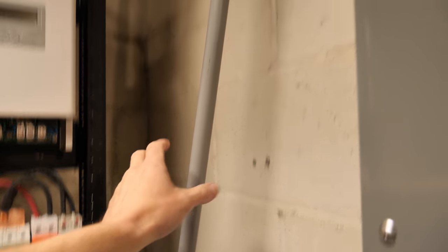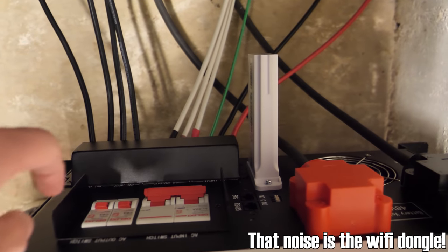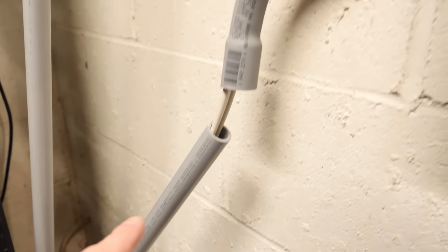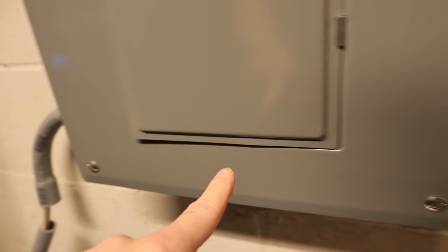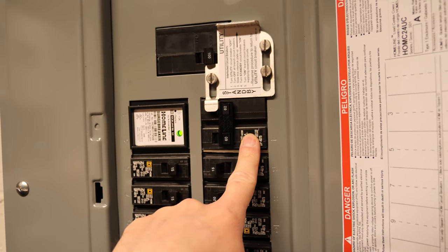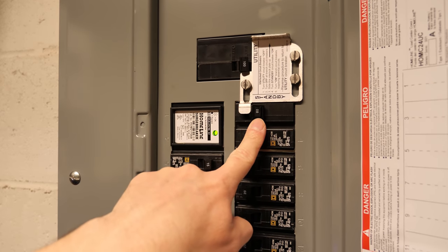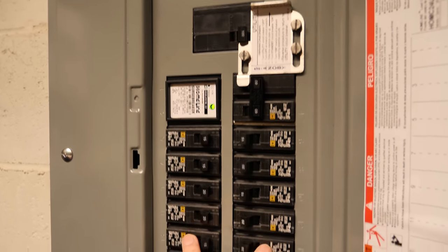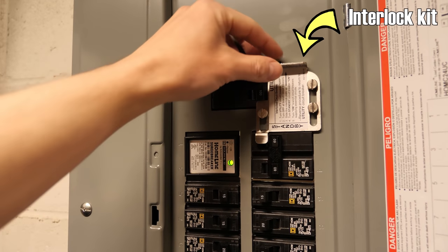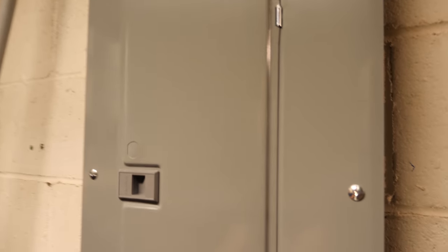If you see this tube right here, that is my power coming in from the grid. Yes it is just kind of sitting there because the plan is to have this go all the way back to the wall. This comes down and into the inverter AC input, and then the white wires come out through this tube and go into my panel. They come out to these two circuit breakers - I put this interlock on there so only one can be on at a time.